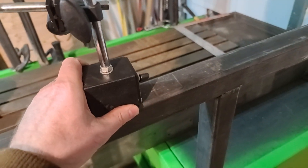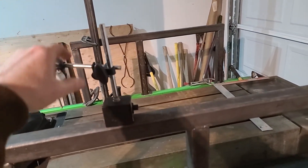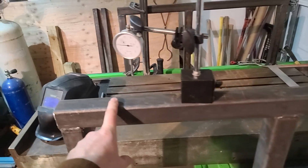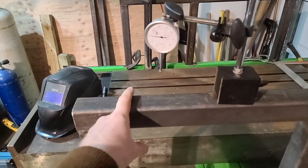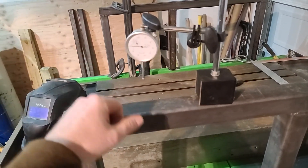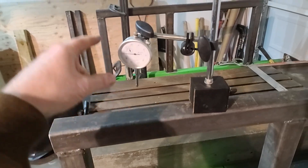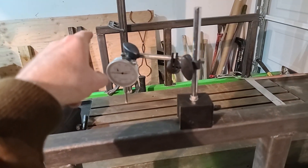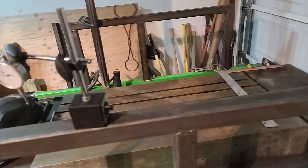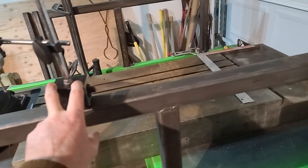To perfect the linear rails, I mount one over here, then as I'm mounting one over there, I use a piece of metal that is going to be just the right length. I press it up against the rail over here, grind it off, figure out what length it needs to be, and make sure it's not something that's going to bend. I use that to set the other one in perfect over there and do the same thing here, so when I run it it'll show exactly the same horizontally.